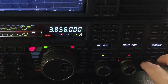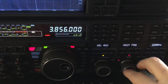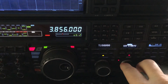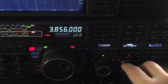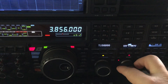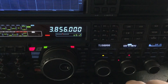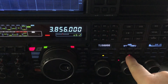If you're in a situation where setting 2800 Hz and the brick wall here is not enough — as I've covered in other videos — you can jump out of the menu and go to the IF stage. Even if your audio is set to 2.8 kHz, in the IF stage you can drop it down; if somebody's interfering from two and a half kilohertz away, you can go down to 2.1 kHz. You can also involve shift and other tools to help out.